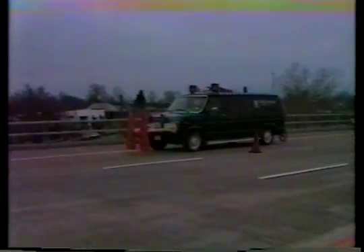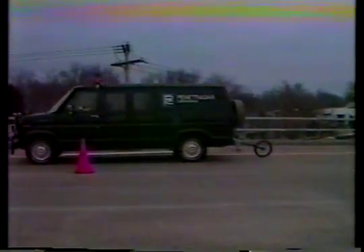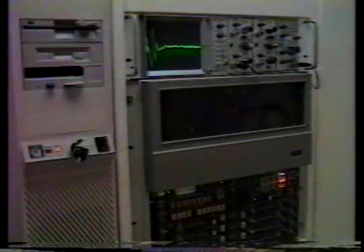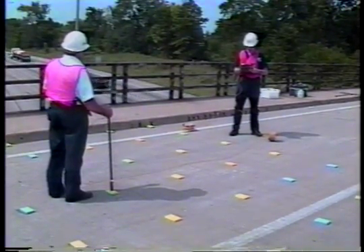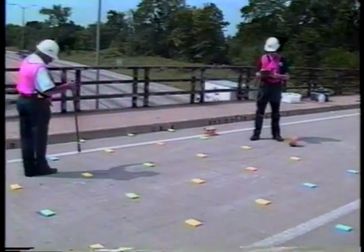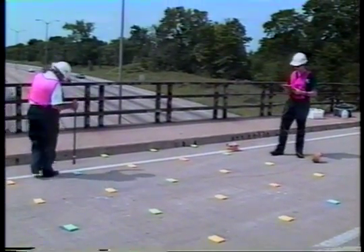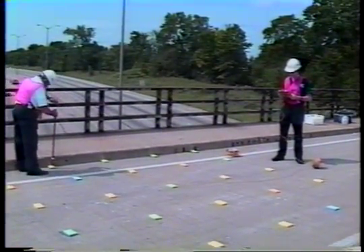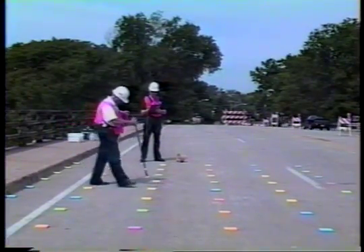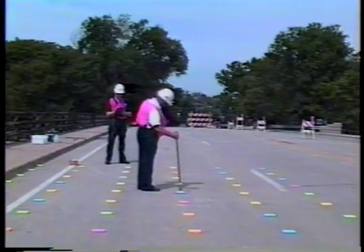Delaminations may also be detected with more sophisticated techniques, such as infrared thermography, impact echo measurements, and ground penetrating radar. Half cell potential measurements are often used as part of the deck survey when bridges are chosen for rehabilitation and overlays. The electrical potential measured between the copper copper sulfate half cell and the rebar steel is an indication of the probability that the rebar steel is corroding at any given location. Large areas of potential values that are more negative than 350 millivolts indicate that the deck is a good candidate for rehabilitation.